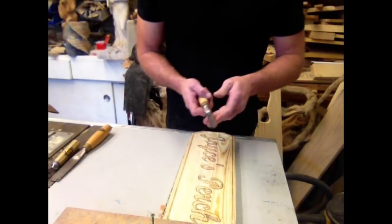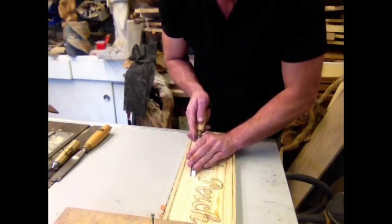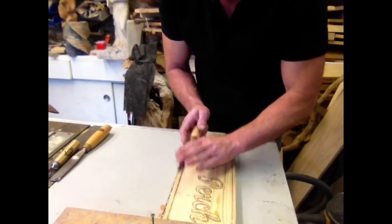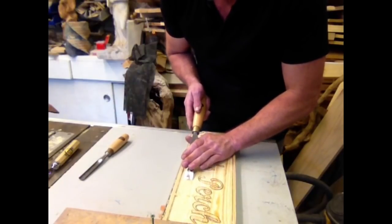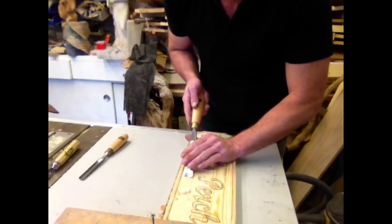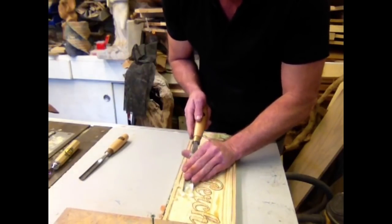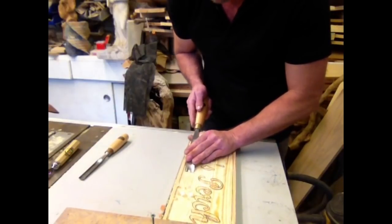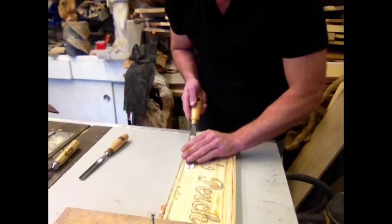What we're going to do is a real light, gentle sweeping motion. The biggest trick is to make sure your gouges are very sharp, and then you won't have any tearing or cutting. You don't want to do one long strip — you just want to do lots of little ones.